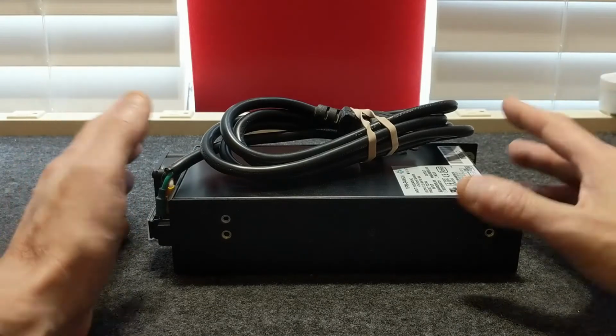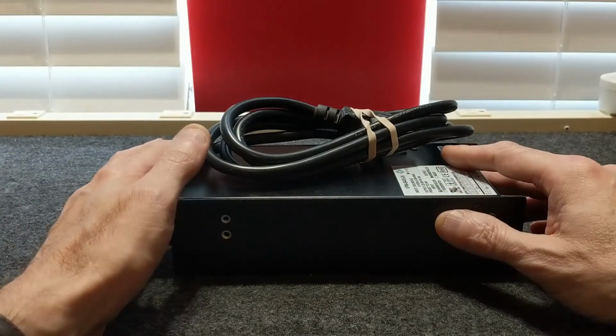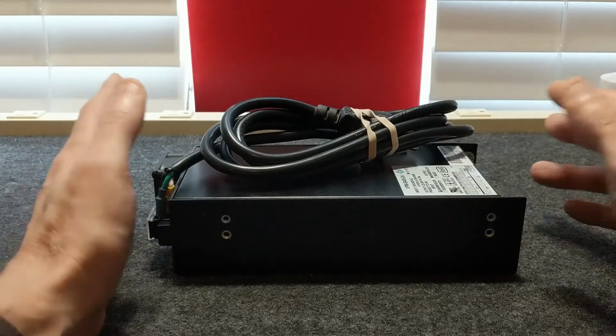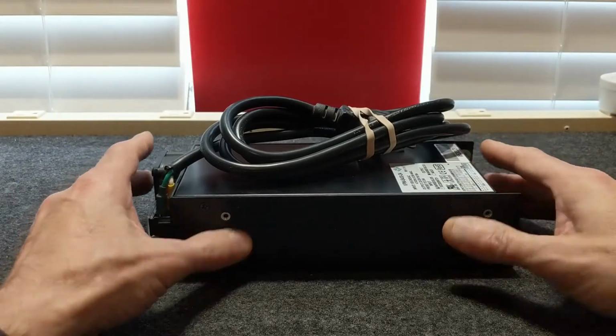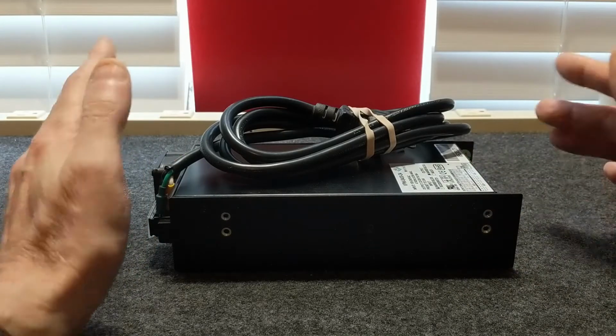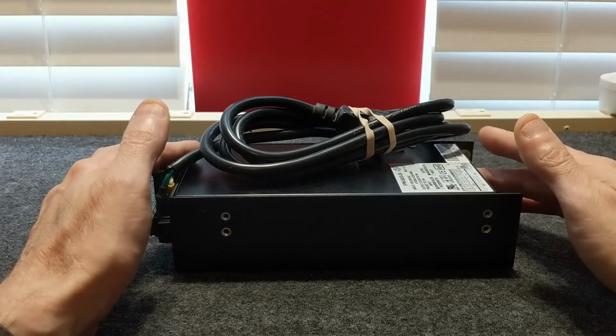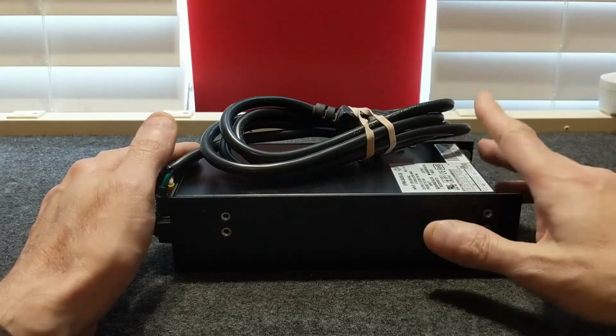Now, because I ended up using this new power supply, I no longer needed the ATX breakout board, resistor, or the inline filter, since the new power supply has all that incorporated into it. However, this also means that I no longer had the 5-volt rail for my USB connector. Not to worry, I had that covered.